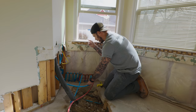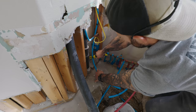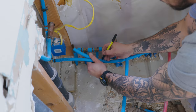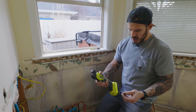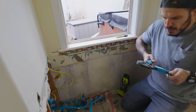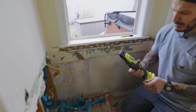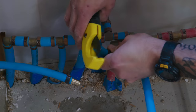Let's reposition. This is cold water going to the outdoor faucet. I'll cut it, pull it out, and make a connection going this way — this is going to be its own little utility box. This is PEX piping — blue is cold, red is hot, using half-inch tubes with half-inch crimping rings. You can use two methods: the old school crimper where you put the ring over the pipe and press it down in the half-inch spot until it stops and you release — a perfect clamp. Or if you're invested in your Ryobi OnePlus system, I have a battery-powered one. Slide it on the same way, press the button, the motor closes the jaws to perfect pressure, then opens. Easy peasy.